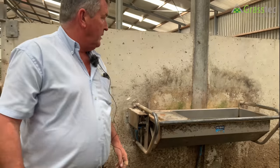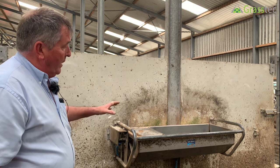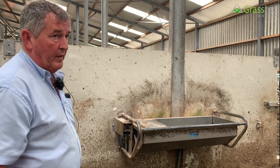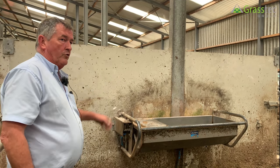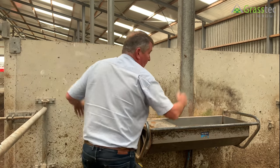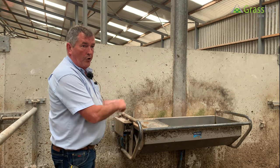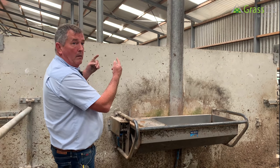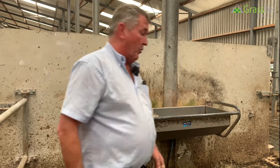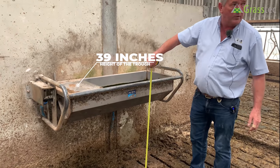A quick flip of the tank demonstrates the design. A valve on inch-and-a-quarter hosing will supply 500 liters per minute. The maximum cows drinking from that tank in a minute would be three, at 15 liters per cow — so 45 liters per minute leaving the tank versus 500 entering. The ballcock supplies water as the main thing in the trough. A bigger trough would give more volume but means turning more volume each time. If you minimize the tank size and make the holes bigger, you get what you want. The height of the trough is between 36 and 39 inches — here it's 39 inches.